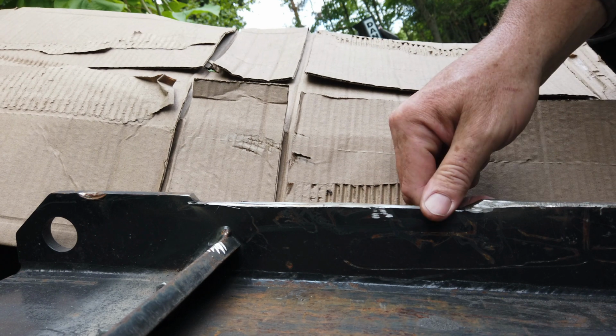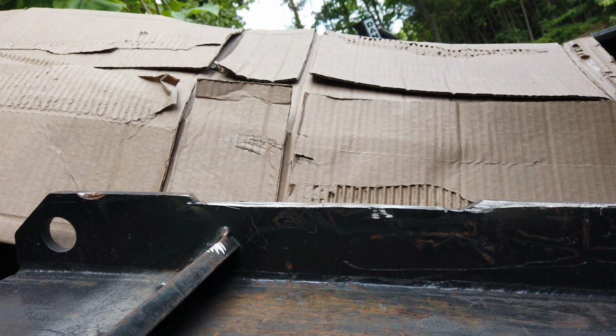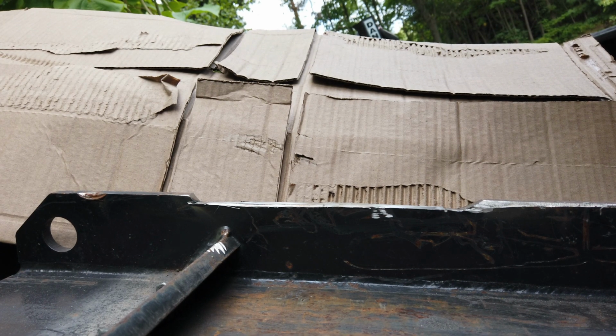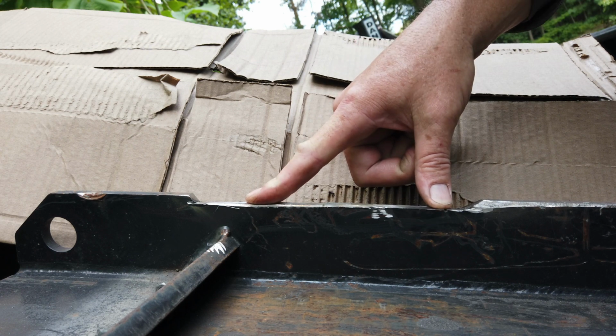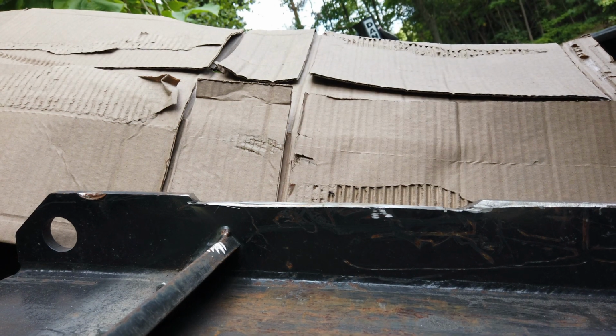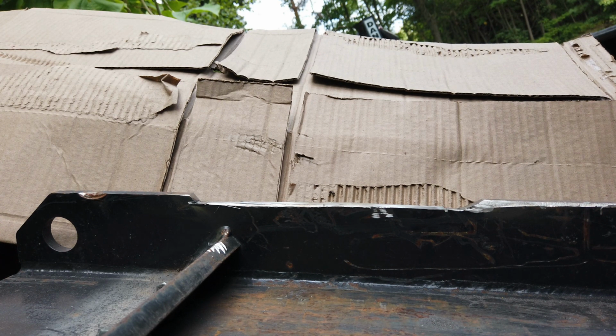So we took 3/8 of an inch out of it, 8 inches of length. That should be plenty, I would like to think anyway. This AR450 plate, 3/8 inch plate, that stuff is hard. Holy smokes. You gotta take your time with it or you're gonna go through a lot of cutting wheels. But I'm gonna go ahead and knock the other side out and then we'll move on to the next phase of the project. We're getting close.